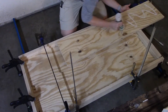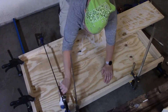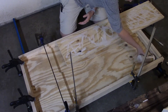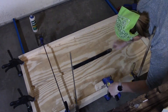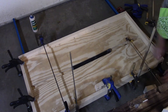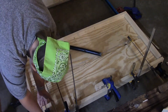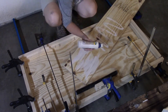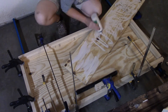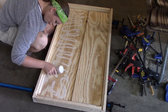I moved the bench to the floor where I had more room and more clamps at my disposal. I glued the top piece in the little notches to the frame and let that dry. Now I'm working on my two inside pieces and you'll see that I'm using that pipe as spacing. I had a small sample piece of that pipe to ensure that no matter where I put those boards, it had room to move. I let the diameter of the pipe determine the total thickness of the workbench — I knew I wanted 3/4 inch on either side of the pipe. Since the pipe measured 1 3/8 of an inch, I decided that two sheets of 3/4 inch plywood would be close enough to work.